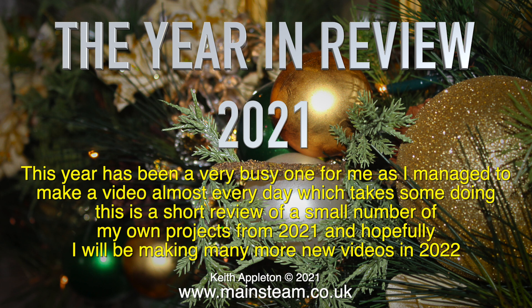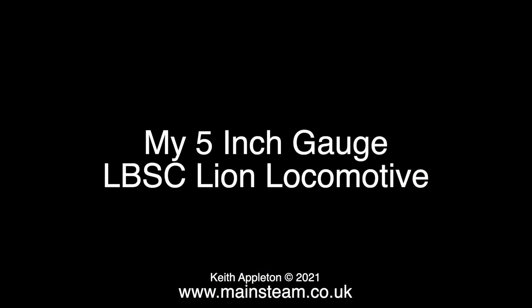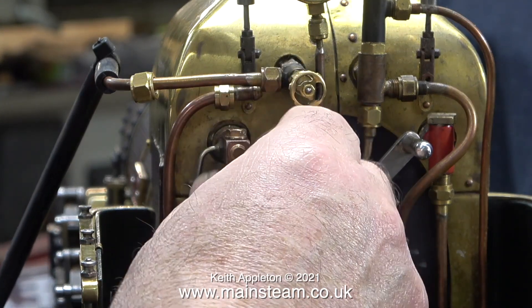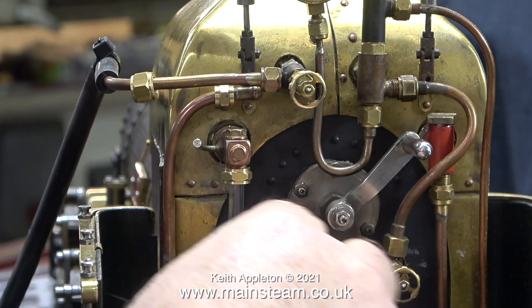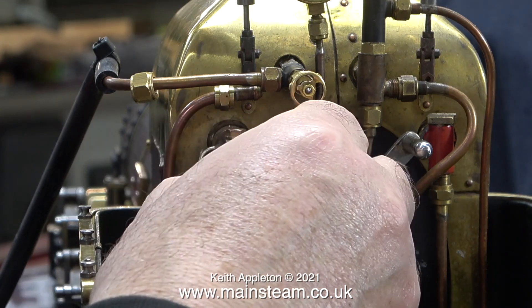The first video in this review features my Lion locomotive. I really like this little engine — it's a 5-inch gauge Lion, originally designed by LBSC. In this clip I've connected some compressed air to the boiler using a piece of silicone rubber pipe, and the water gauge is leaking really badly where the nuts hold the glass in place. I can clearly hear the sound of the air leak and feel it blowing on my hand.